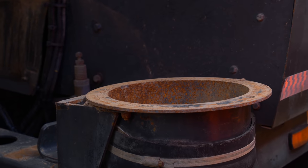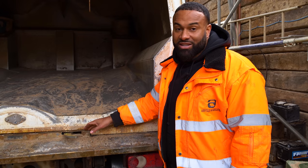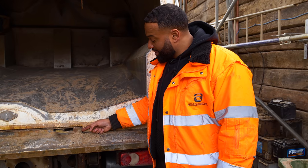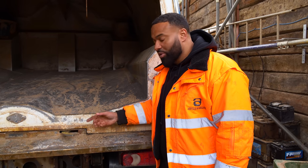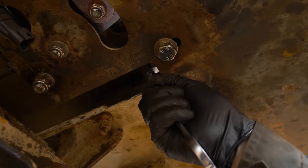Here, I've removed the top of the paint can and the stone. No longer needed. We're gonna tighten this up a bit more, and then we're gonna hand tighten it at the end. And the adjuster bolts on the side here, we're gonna use them. When we use the adjuster bolt, it's gonna bring this in a bit, and this works out how tightly closed this is gonna be. But we don't want it to be too tight, so we're just gonna bring it just close to flush, and that should be perfect.